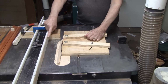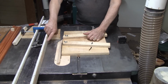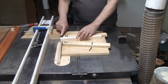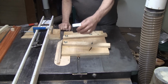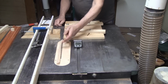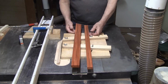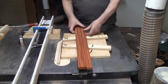That's my stop. I want that stop away from the fence. I don't want to use the fence for a stop. And as soon as I index this piece, I want to be away from it before I get to the blade. Otherwise, that'll bind as well. All right, that's a couple tips. Besides that, I use a digital angle finder to set the blade at 90. Okay, let's go ahead and start cutting these segments and make my very special segmented turning.